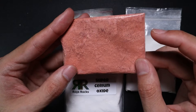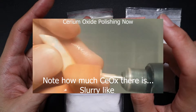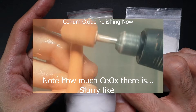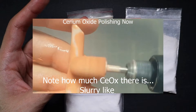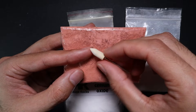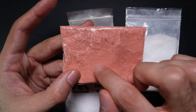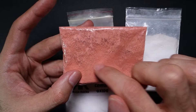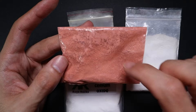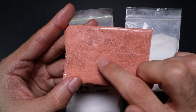With this stuff, I've found that you want to run it a little bit thicker than you would normally run a super cerium oxide — a little bit thicker — and towards the end you want to run it till it's just about getting dry on the burr. I suggest using felt burrs, really dense. The denser the better. You can also use leather. I don't recommend wood; wood is just for diamond paste. Running it a bit thicker and a little bit dry towards the end, I think it actually grinds up the powder a bit more — it seems to be self-grinding itself.